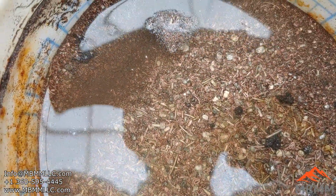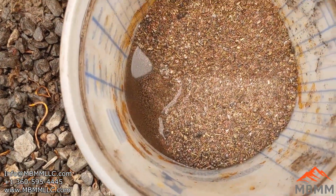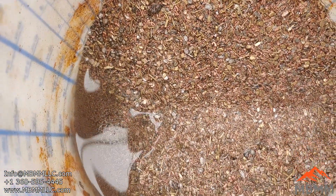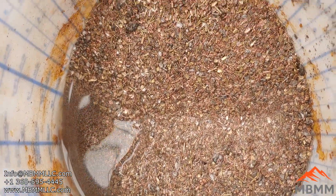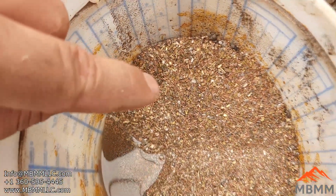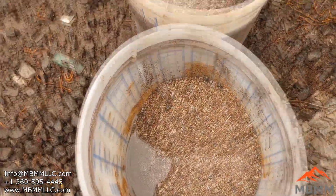The interesting thing, and I couldn't say it when I was taking the video, is the amount of material that was coming over into the number 1 varied. And it didn't seem to vary with the amount of material on the table. It seemed to vary with the characteristics. So if there's a lot more gold pins and some of these larger gold or copper wires and stuff, it would flood over into the number 1 and make a really wide band. It'd be 2 or 3 inches wide.